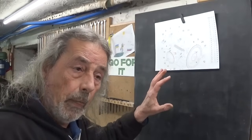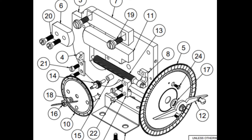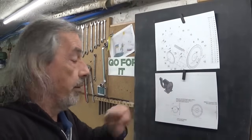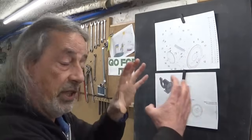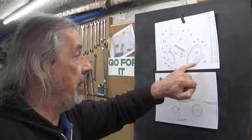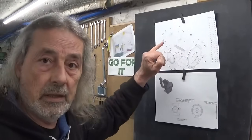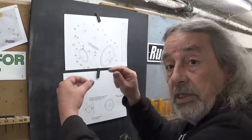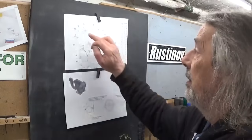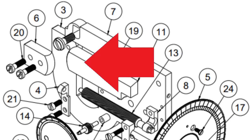These guys are amazing. As you can see, the thing is complicated. There are two dials. I have another plan here. Two dials. There is a threaded rod here in the middle and a kind of friction bearing in two halves. And then I will have to make these dials and these pointers, and it is challenging. There are also two parts here where the measuring things, anvils come together. These are rounded, but these are combined radii. I have no idea how to do this.